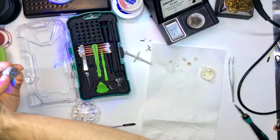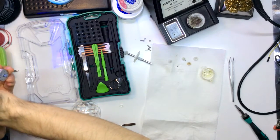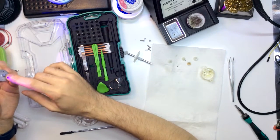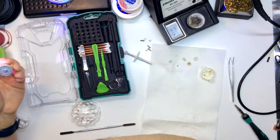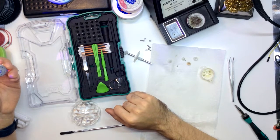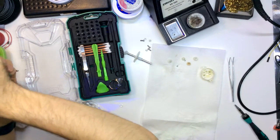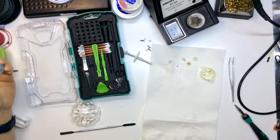Okay. Oh wow, those are really bright. So that's providing some really fascinating effects on the wall with the three colors of the light mixing. Anyway, so that motor is spinning along really quite happily. So I don't think anything is wrong with the motor, which means that something was wrong with the way these gears were interacting. I'm going to troubleshoot that a little bit further in a moment. Let's keep those LEDs out of the way.